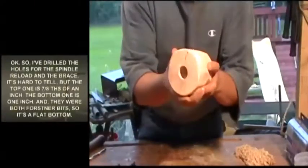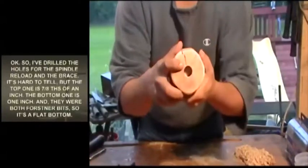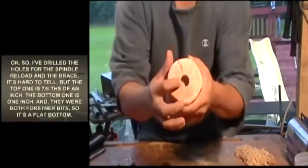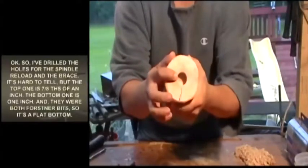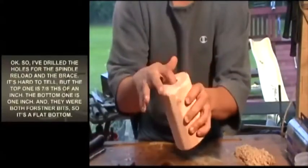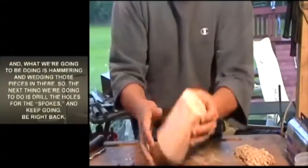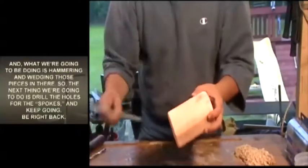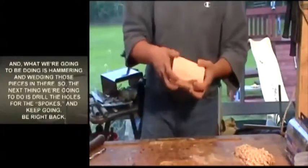Okay, so I've drilled the holes for the spindle reload and the brace. It's hard to tell, but the top one is 7/8 of an inch, and the bottom one is 1 inch, and they were both Forstner bits, so it's a flat bottom. And what I'm going to be doing is hammering and wedging those pieces in there. So next thing we're going to do is drill the holes for the spokes. And keep going. Be right back.